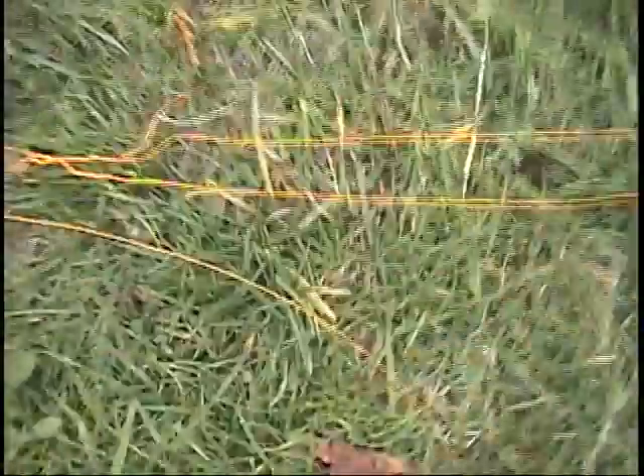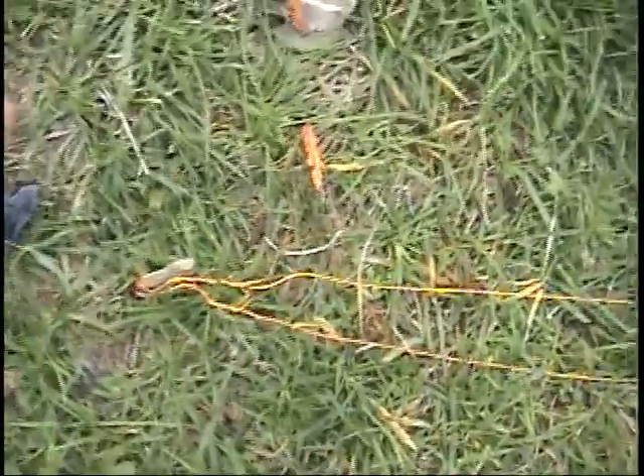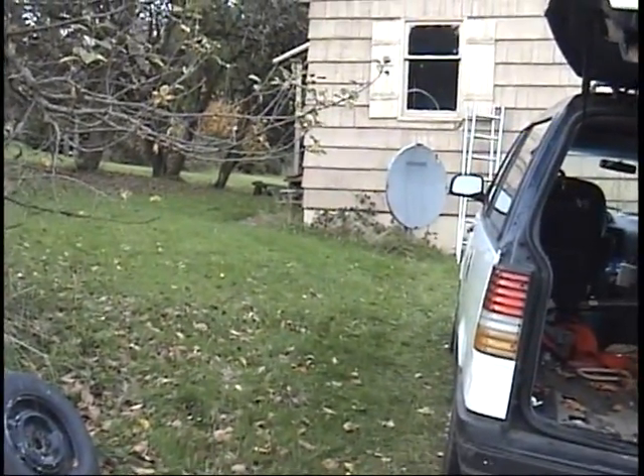So there's a 96-foot length of 22-gauge wire that stretches that far. Right here I put a stick in the ground — a little chopstick — and it has two wires to it. That's 43 feet from here to that dish thing down there. So I've got two lengths of 43 feet coming here and one length of 96 feet that goes the full length.